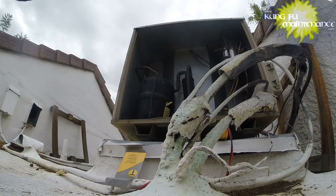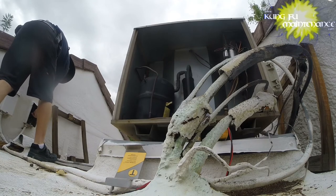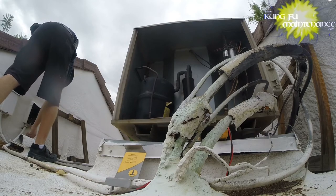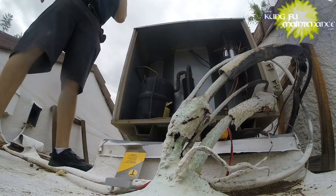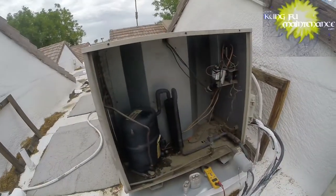2650 times full load amps divided by voltage equals capacitance. By the end of this video, I'm going to have it memorized too. Got just the fan motor running good. Okay, so I'll go get some ice and then check this out. To be continued.